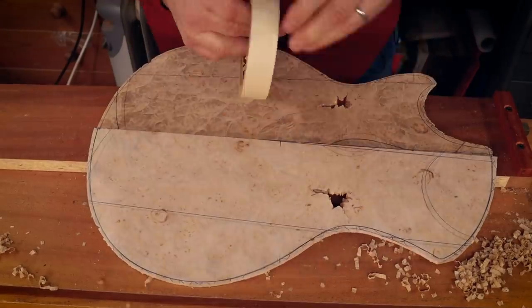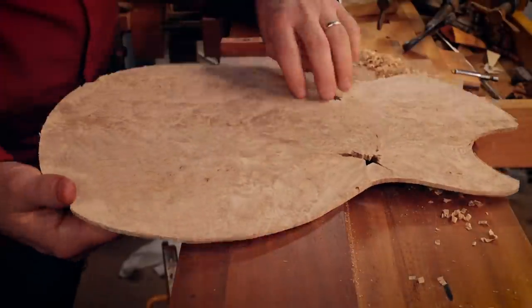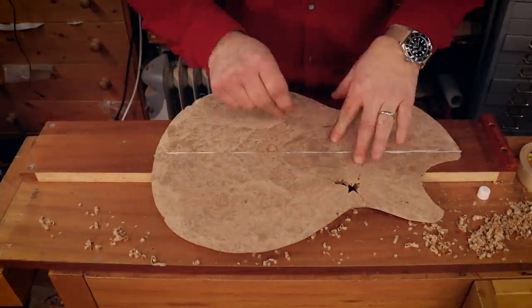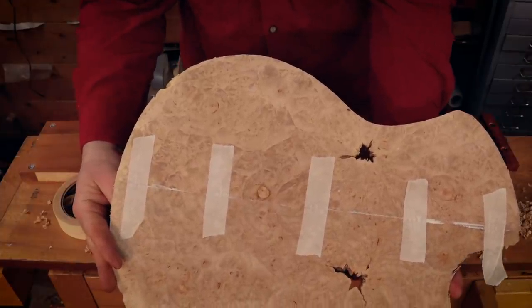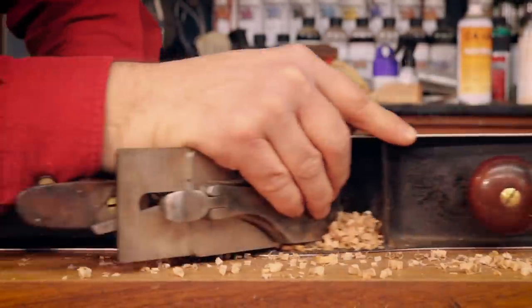And we're going to clamp it together with masking tape. Done. Under tension. And good to go. The nice thing about doing it that way is that there are no massive clamps holding everything down, and a well-planed joint means that you don't need huge amounts of pressure. Basically, this is better. If you can't hold a joint together just with the tension of a couple of fingers like that, then it's not good enough.